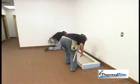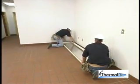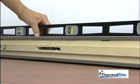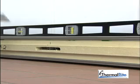When you're installing a walk-in with the Thermalrite manufactured floor panels, use your blueprint to lay out the panels correctly. Use a transit or large level to be sure that the manufactured floor panel is level as it is being installed. If the building floor is not level, the walk-in will not be level. Use shims to level the floor panels.